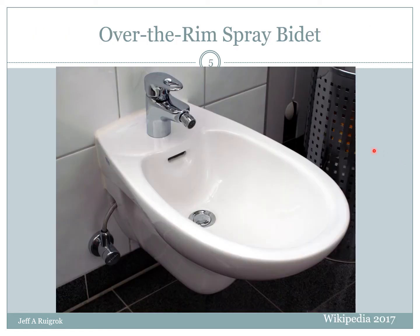This is very similar — this happens to be a wall-hung bidet, which is more European than North American. Regardless, it has a very similar setup but it's called over the rim. This would send the water straight at your butt and give you a chance to wash up that way. Again, you can see the relationship between the hand wash basin and this over-the-rim butt wash basin. This hole here is actually a little overflow, so if you had the fixture outlet pipe or PO closed and the tap was dripping or something, the excess water would go down that overflow.